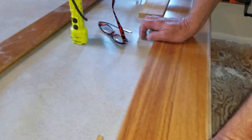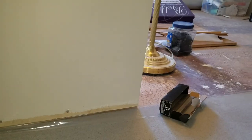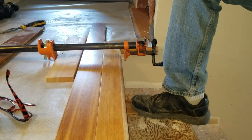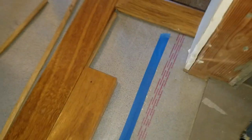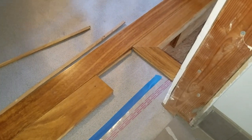We install normally going out the rest of the way into this bedroom and that bedroom. Then from this starter board, we put spline all the way across, turn the boards around, and nail in from the other direction. Just a little thing you need to know to install oak flooring.